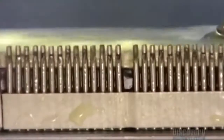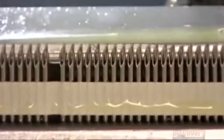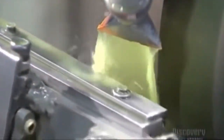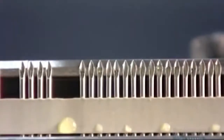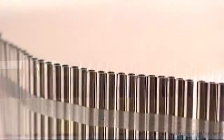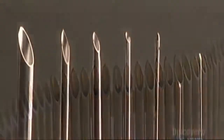Now the fixture rolls and rotates the tubes, then it's back to the grind. The angle of the wheel is changed so that it sands the sides of the tubes. These two secondary grinds sharpen the tubes into a finer point. This is how they looked before grinding, and this is after — with their sharp needle tips.